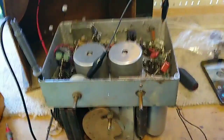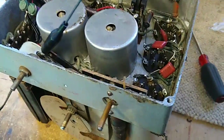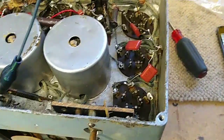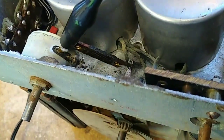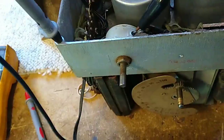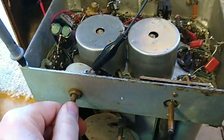I think I know what's going on here finally. This schematic really doesn't add up to what's going on here. What I've discovered is that I think this gain control here is at fault. This controls the resistance to ground for the cathodes, and I was noticing some strange voltage on the cathodes of the RF tubes. This resistor here also is pretty high value - it should be close to about maybe five ohms, but it's about 200 ohms. So just for grins and giggles, I grounded the low side of this control to bring the cathodes down.